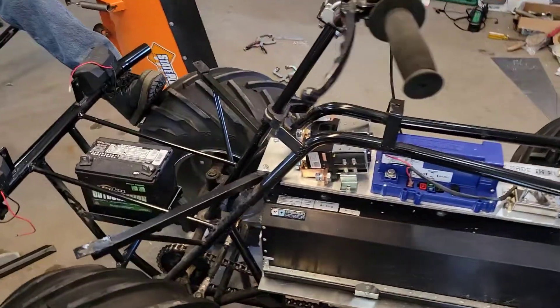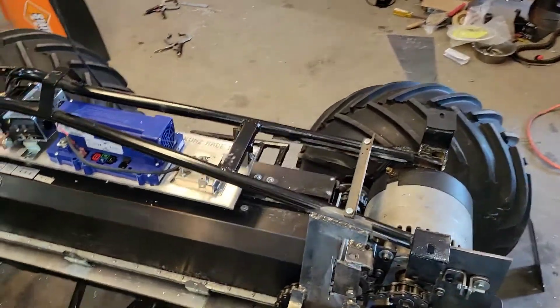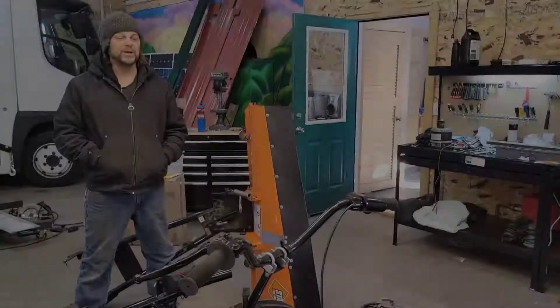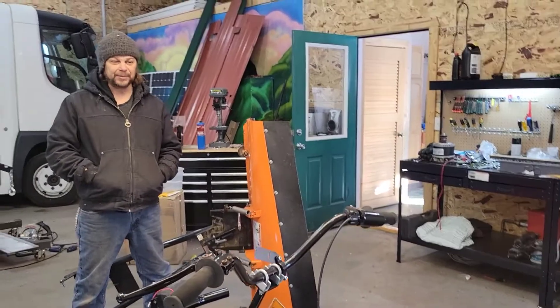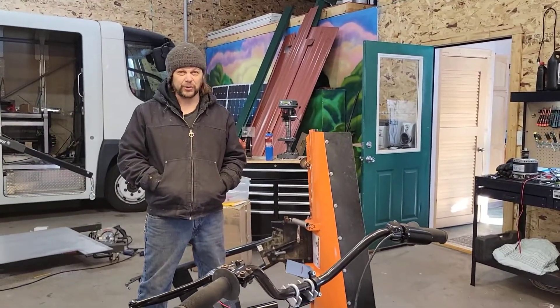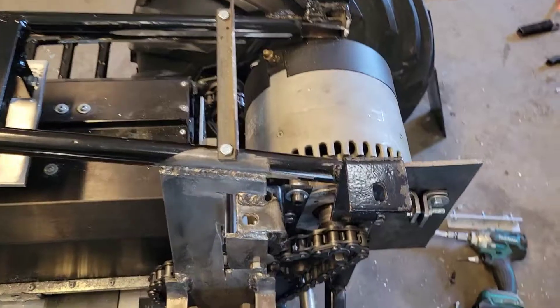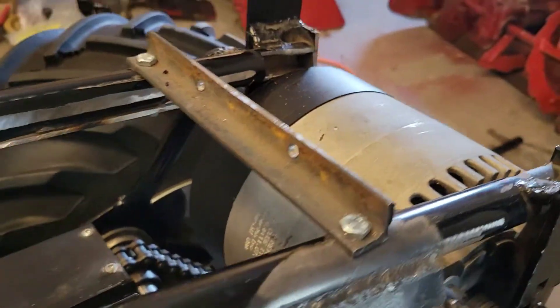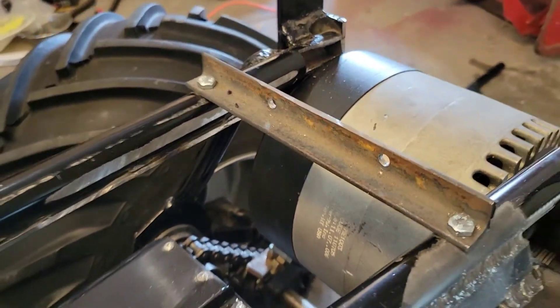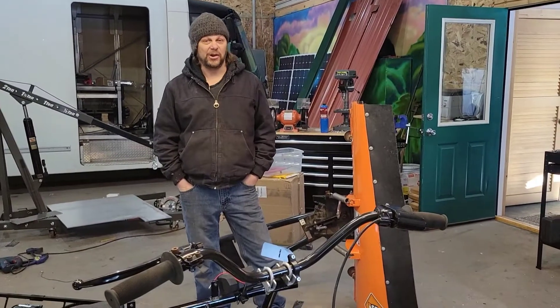As you can see, it's pretty much just a big battery on wheels. It's a nine kilowatt GEM car battery made by Bromo. We can pull continuous 200 amps out of that battery, probably 400 or 500 amps in short bursts, which is what the ME1003 Mars motor right there will do. At 48 volts — we'll probably be loading around 40-45 volts — you're looking at a solid probably 25 horsepower, which is incredible. And of course with an electric motor, you have that torque all the time.